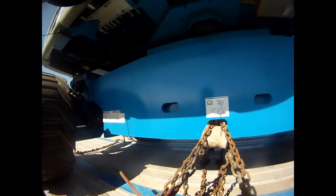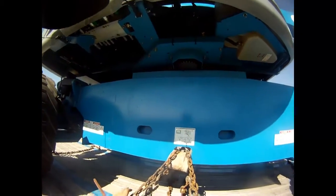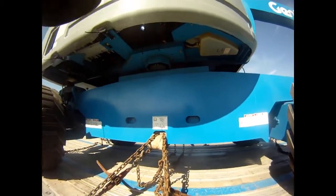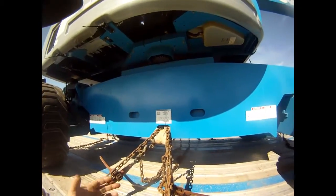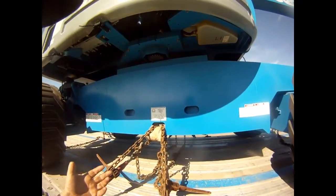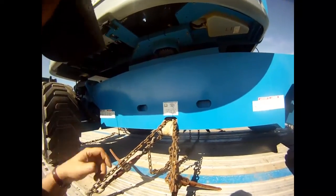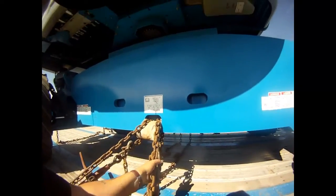Now, normally you have these two spots on this particular lift, and there's even a little diagram, but they only left one. But I still am using single chain to binder, so that divides it up into multiple different devices and weight specifications for those. It will raise your securement level quite a bit by using this method. There's a reason for that, because it is trapped in a loop, a chain loop. It's not just a chain.